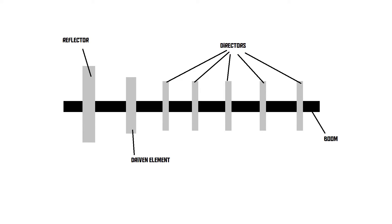The type of directional antenna I'll be using is the Yagi antenna. It consists of a boom — basically a stick that everything is mounted to — some directors, which are passive or parasitic elements, a reflector, which is also a parasitic element, and the driven element, which is the part actually connected to the access point. The directors and reflector are not connected to anything; they are passive elements that guide radio waves to and from the driven element.